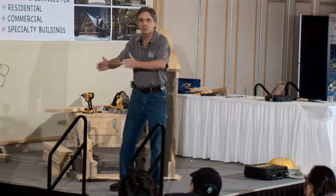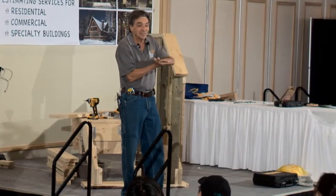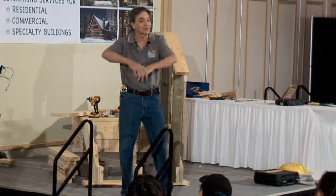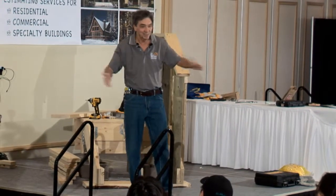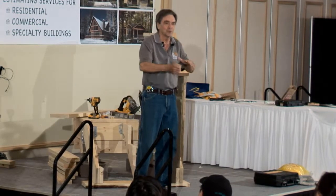And if you actually put the boards up, for instance, two boards that butt together, there's no way to get the end-cut treatment there if you don't do it before you put them together. And so you've got to do this stuff before. Because where's the only place you forget end-cut treatment? Between two boards. That's where it rots. Okay? The rest you could put all over. You could put all kinds of things on top of the deck. But you can't get it between the two boards. And that's where we need to get it when we're actually working.